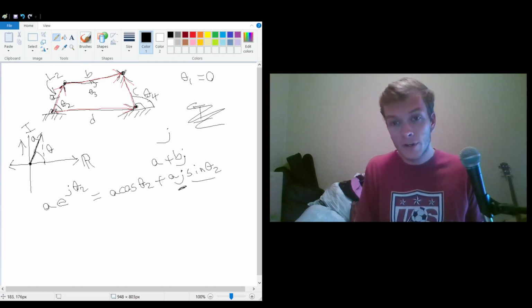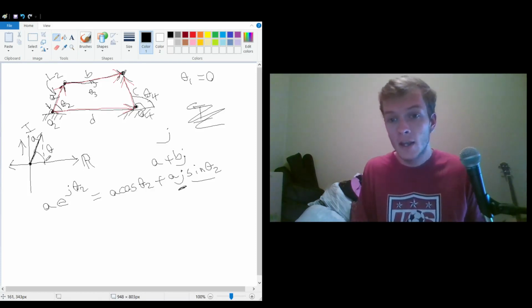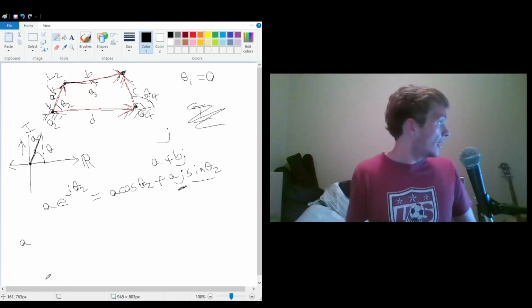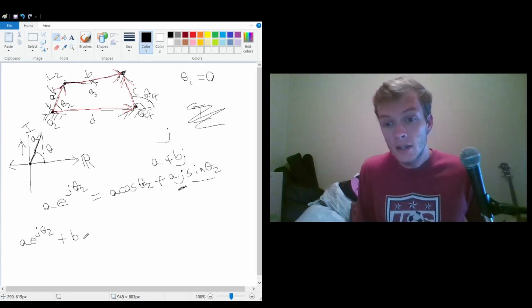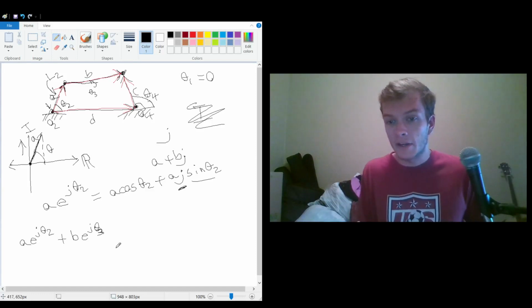So first off, we're going to start here at this point. We'll call this O2 and this O4 just for reference, for origin. So we will say that A times e to the j theta 2 plus, and so we're going to have our vector B times e to the j theta 3. Okay, so we're here. Now we're going backwards in accordance to this vector. So we're going to say minus C e to the j theta 4.